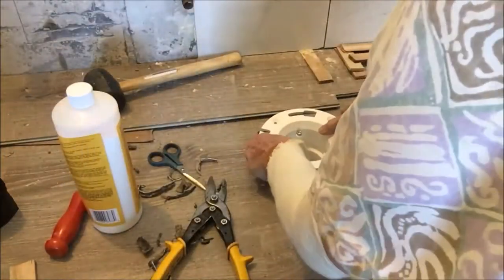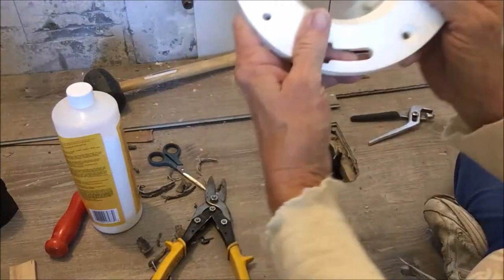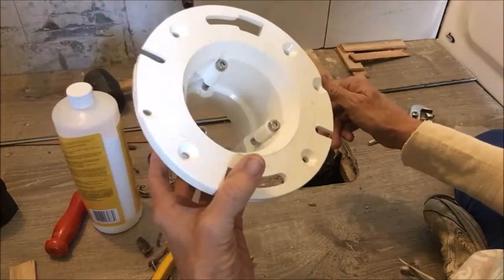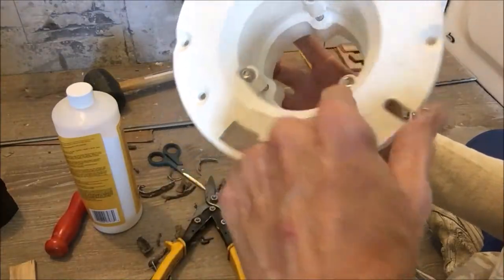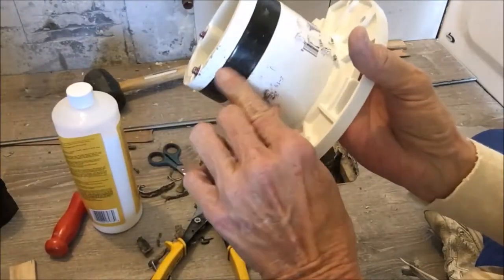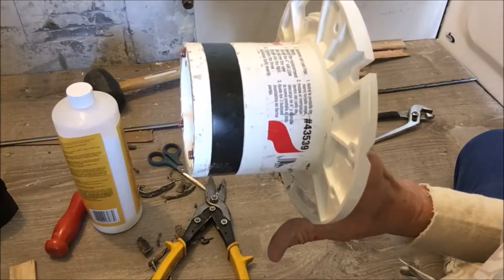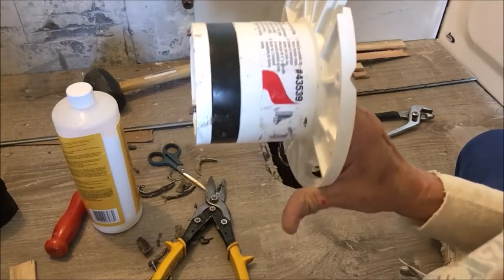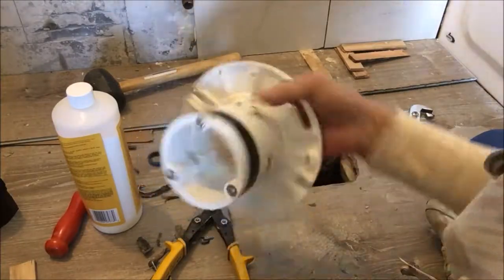There. Okay. Now, you seat this in there, and then you take an Allen wrench. Oh, yay. Let me go find an Allen wrench. Anyway, when you tighten, you screw these. This band expands to make a tight seal. Now, on this lead pipe, I definitely don't want to do it too much. But I do want a good seal, so I'll have to try to peek under there somehow. Make sure I'm not overdoing it. So, let me go get my Allen wrenches.